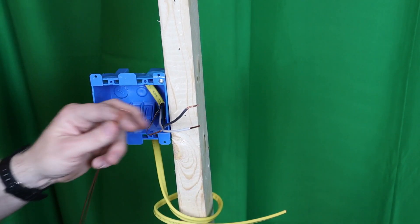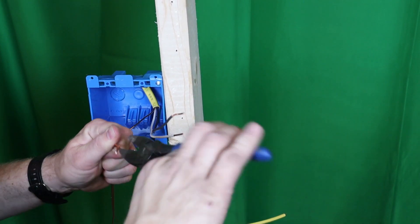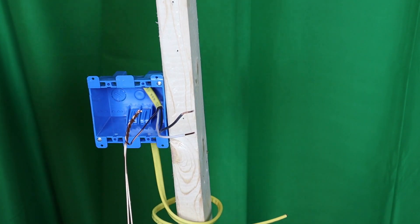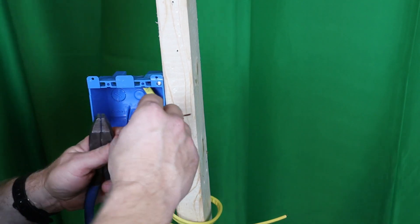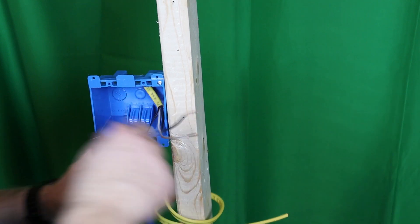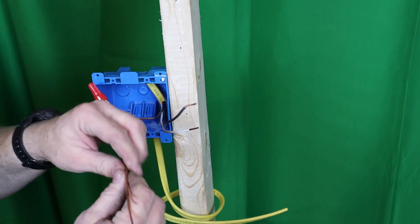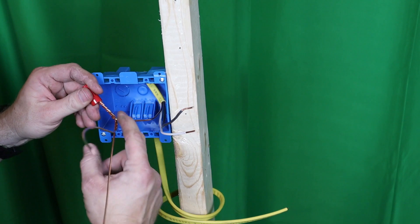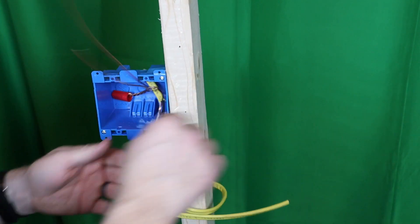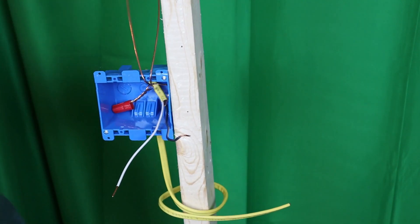What we're going to do is take our wires and twist them together. You always want to twist your wires — never just put them under the wire nut without twisting. I have another video on how to make the perfect wire joint if you need it. Your grounds are done. Tuck them back in the box. If you had another ground, you'd add it under the wire nut too — you'd still have two pigtails sticking out.